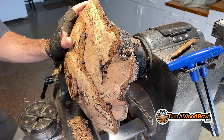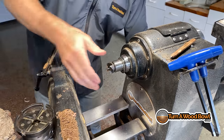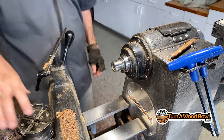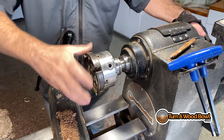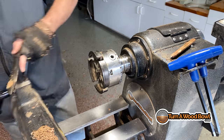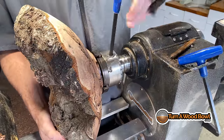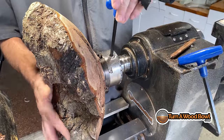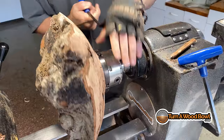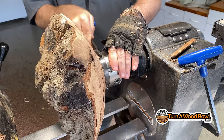We've got the exterior done, and I'm going to put this now in the chuck. We take our spur chuck out — done using that. I'm going to put the four jaw chuck in place. I really want to make sure that it's held in there firm, seated nice and flat and flush on top of all four of the chuck jaws, and snug it up on both sides.